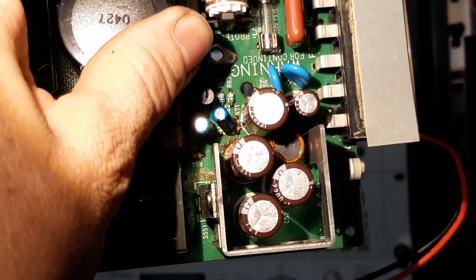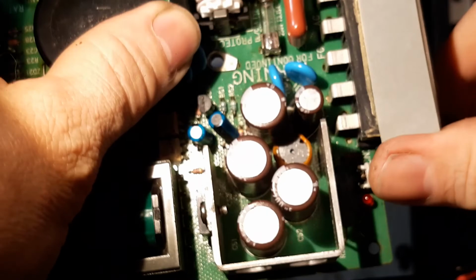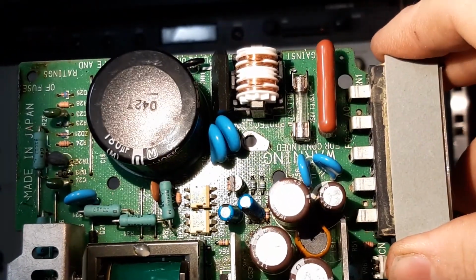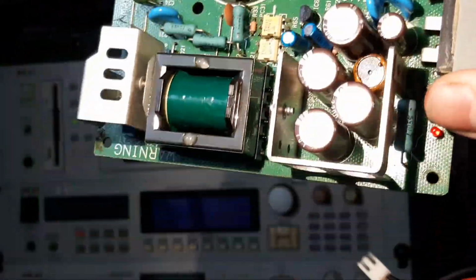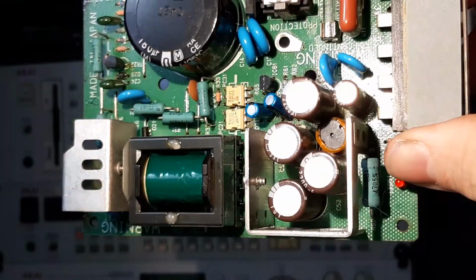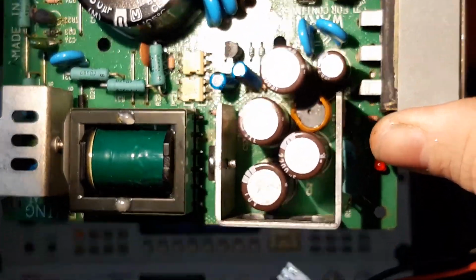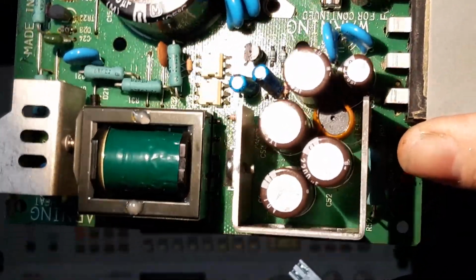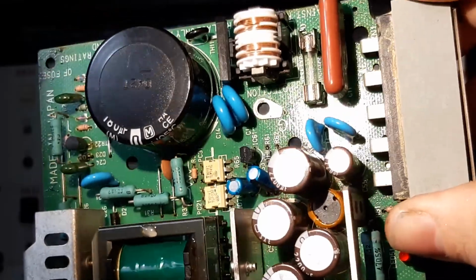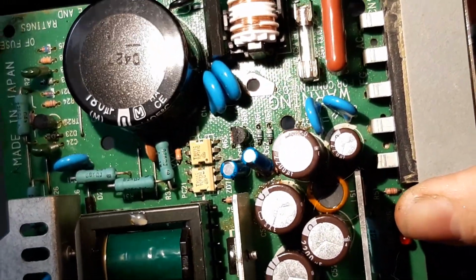So moving right along, we've got to get these guys out because I don't like to order until I've got things out, because sometimes you'll find something else whilst you're carrying out that process. So we are going to flip this board over, mark up the feet of the components that we need to desolder, and desolder. For desoldering, you want to make sure you've got a good hot soldering iron, preferably one with variable heat control.